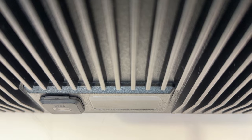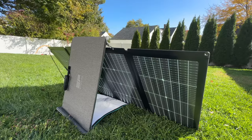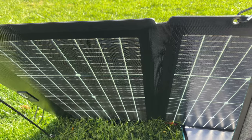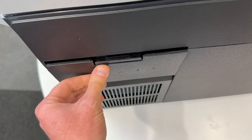The fourth way to power the Glacier is through solar, which is very unique — it includes a 180-watt solar input. I plugged it into EcoFlow's 220-watt bifacial solar panel and it charged up in two hours and worked great. It's important to note that it cannot run directly on solar — that only works if you have the internal battery installed.